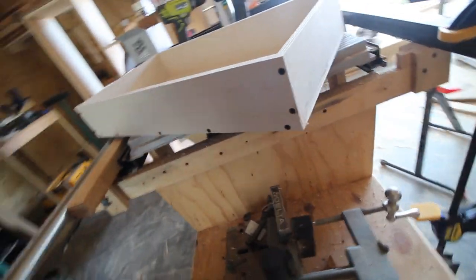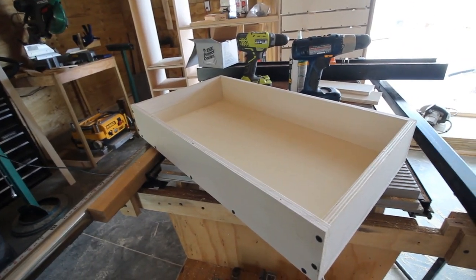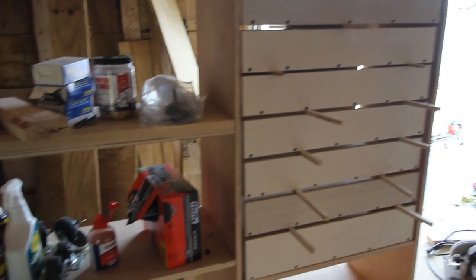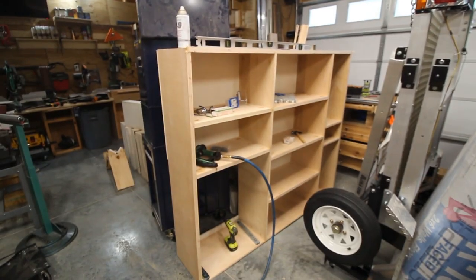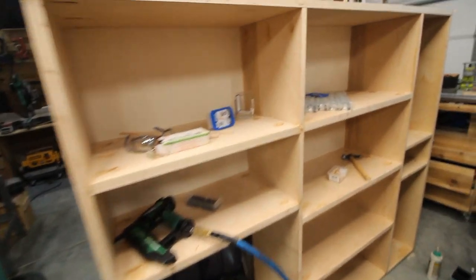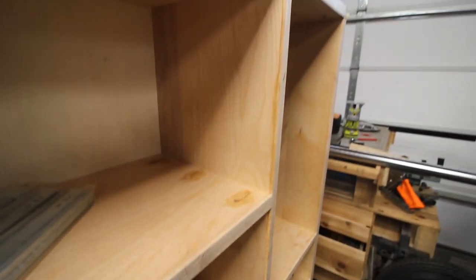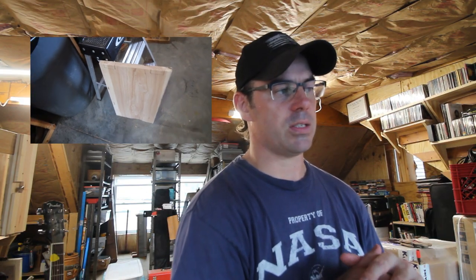The drawers are done. I got the right spacing using half-inch plywood spacers. I had bought a four-quarter hickory rough-sawn piece of wood from Woodcraft and used that to trim out the front faces of the frame so it looks like solid hickory, but it's not.